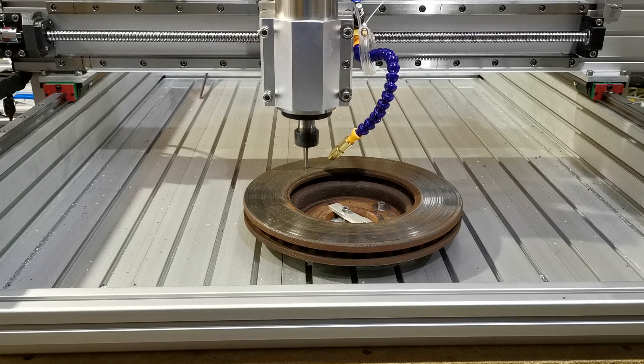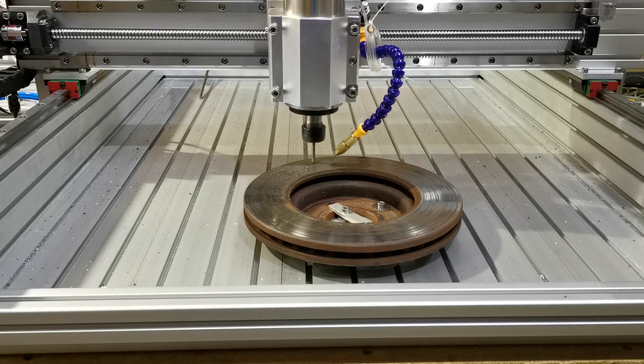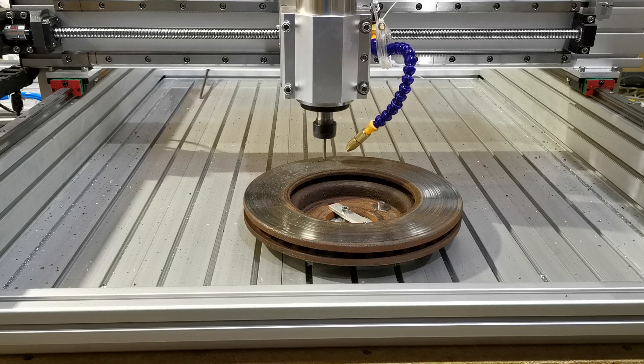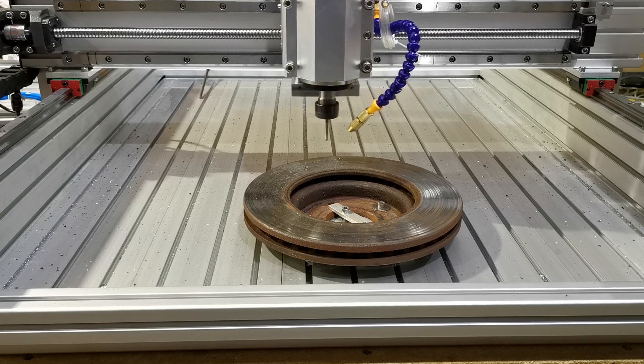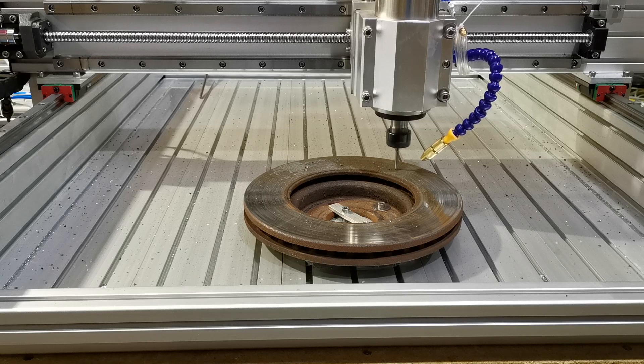This is a carbide drill. You'll see we're just doing a very small drill at the moment. As it goes around the surface it will go deeper. This is for reference only — we're not blowing air just to show that we don't need to with steel. It's now just doing two millimeters deep.